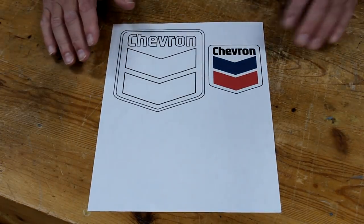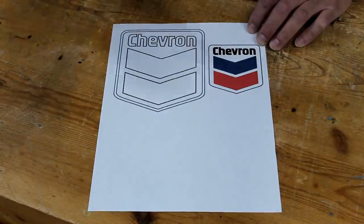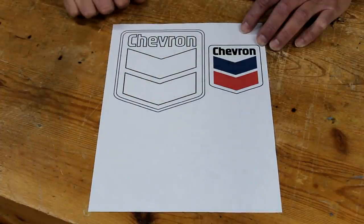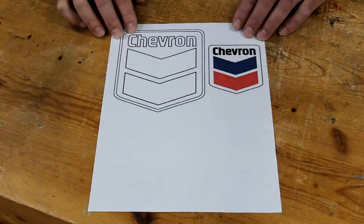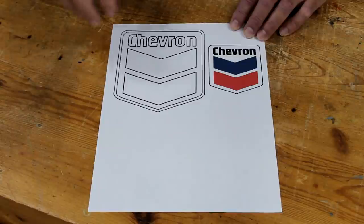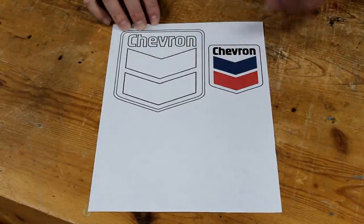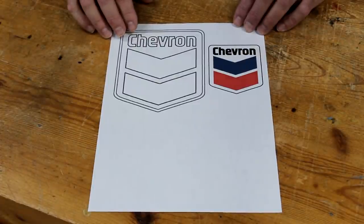Finding the templates for road signs is pretty easy — I just searched Google Images for the ones I wanted. In this case I searched for the Chevron logo and found it. I copied and pasted the logo into Microsoft Visio and drew shapes over the top of it to make cutting lines for a cutting template. I also kept the original logo to reference the colors when I paint it. These are basic segmentation projects where I glue the template onto a board, cut all the pieces out, take it apart, sand everything, paint it, and then glue it all back together to make the sign. You can search Google Images for a company logo or an actual photo of a sign — just make sure it's a straight shot so it's not skewed, so you'll have a good template to use.